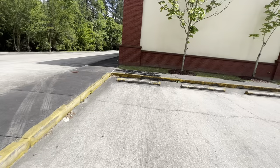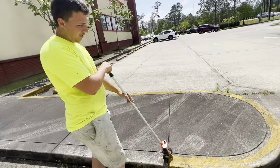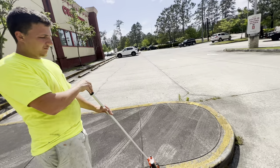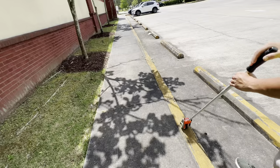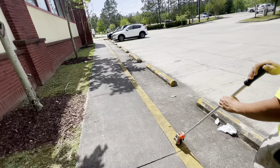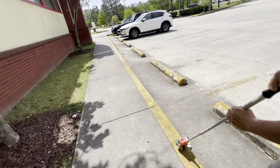We're going to measure this curbing using a measuring wheel — I think they cost around 20 bucks, but that thing has made us hundreds of thousands of dollars. You don't want to estimate curbing footage. Apex is measuring now, and he's been instructed to check that number occasionally to make sure it's making sense. Believe it or not, I've had a measuring wheel go crazy — 50 feet ended up reading like 12 feet — so verify it makes sense.